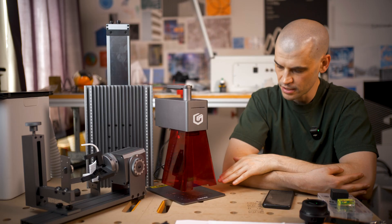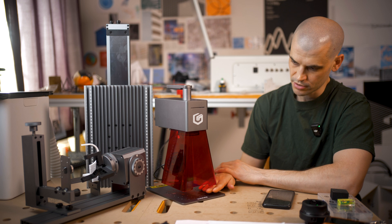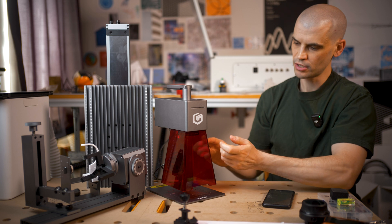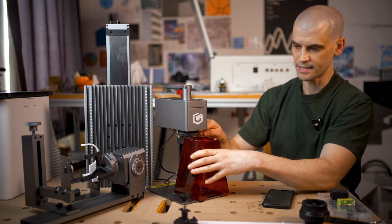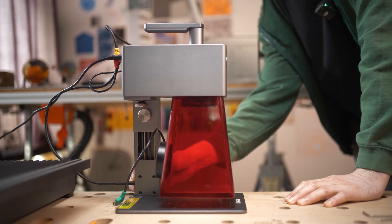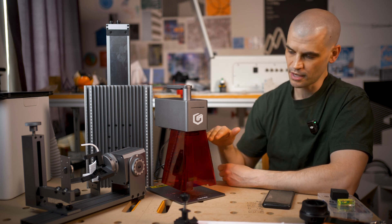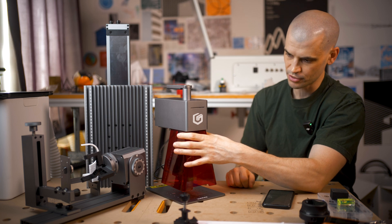When you've got this hood flat against some material, the fume extraction is good — the fan does a good enough job. The issue is that if you are using the accessories, you can't use this hood, especially with the slide extension. Also, you can't slide the hood on and off — it has to come down and clear this lens, which means you have to use the controls on the arm to move the head up and down. Moving it up and down is actually pretty slow, and this really hurts your productivity when you want to check on your engraving or swap out a new batch.